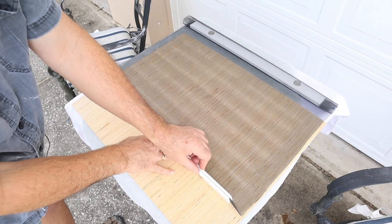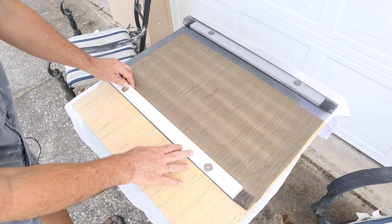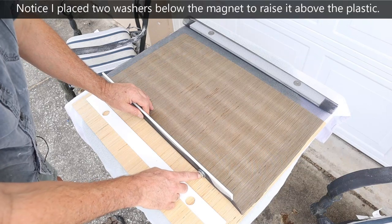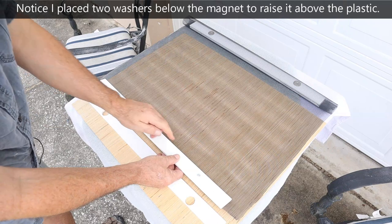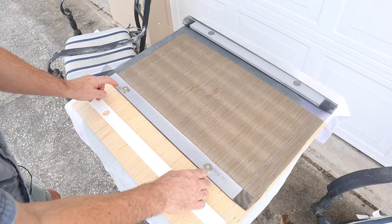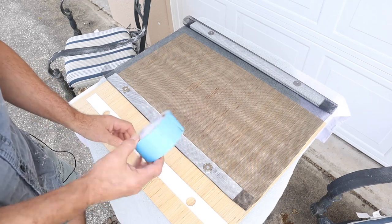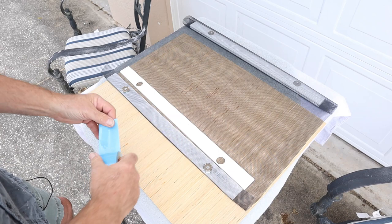As you can see here, I've got two pieces of PVC plastic, which is actually lattice trim — I'll leave the part number for Lowe's and Home Depot in the description. What I did was cut two one-inch holes in the first piece of lattice trim. In the matching piece, I screwed the magnet with a number six bolt and countersunk it so that it would be flush, because I didn't want the nut wearing out the screen since I know I'm going to roll this up. Now all I have to do is somehow keep this screen from pulling out. To do that, I'm going to use this double-stick duct tape — I didn't even know there was double-stick duct tape. There's a link to this in the description also. So that's going to go on there like that.